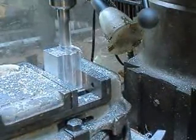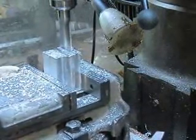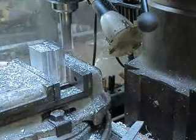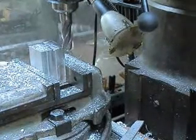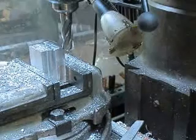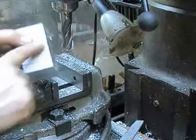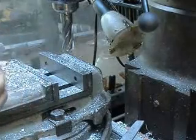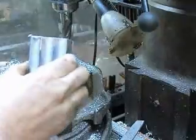Okay, one last side and we're all squared up — let's go ahead and whip that out. That looks like about it. Okay, we got four sides done and I think we'll stop there for now. The rest of it we're probably going to throw in the lathe and polish these surfaces in the lathe because it'll be easier. So I'm going to go over to the grinder and take off all the little scrappy stuff and be right back.